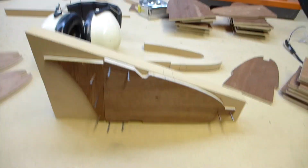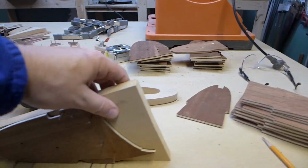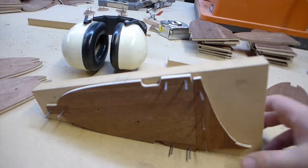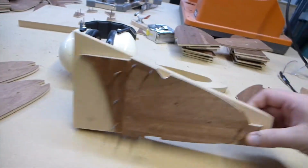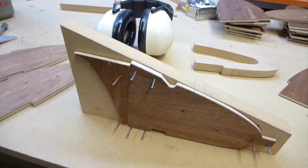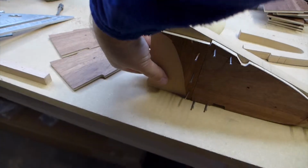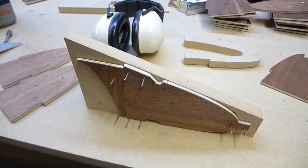And some of you may have been wondering, the way the table saw is set up now, I can clamp this to the miter fence, but then when I flip it over, how do I clamp this into the miter fence? There's not really extra material to grab onto. Well, there's two miter slots on the table saw, one here and one there. And I'll just swap this over to the other side, so I use that miter fence so I can clamp onto there. That's the idea anyway. I think that'll work fine.